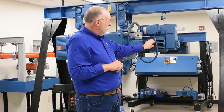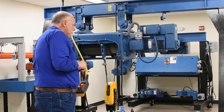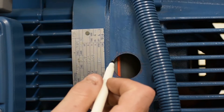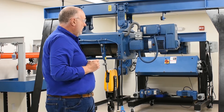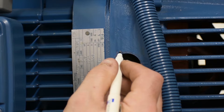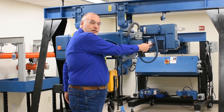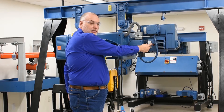So it's better to remove it altogether, and then energize the hoist at the leading edge of the orange line. Then make a second pencil mark when there's no energy, and the distance between our pencil marks will be the measured axial displacement for this motor. We will physically measure it and compare it to a published maximum and minimum value.